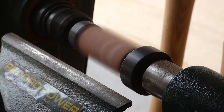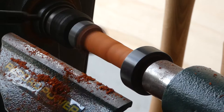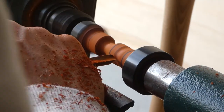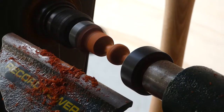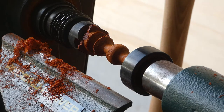It's a pretty simple design — I actually didn't design it at all. I just chucked something up on the lathe and figured it out as I went. You get it down to a circle, figure out where you want everything: the deepest points, where the end is, where the middle is — the little details for making a handle. You also have to make a little mortise at the bottom so it can actually sit on the lid.